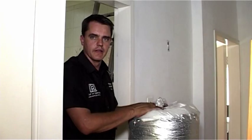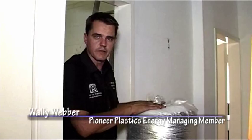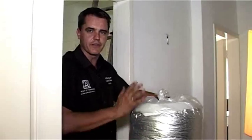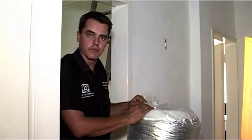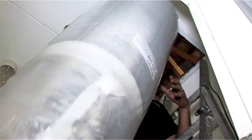We've done the pre-site inspection and cleared the roof as safe and viable to do the product. As we've discussed, the rolls are done in five meter rolls, nice and compact to get through the manhole, and the rolls are also pre-slit — the 800 and the 400 — to fit nicely in between the roof rafters. Let's go back to the roof and start installing.